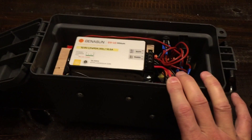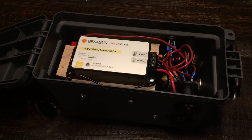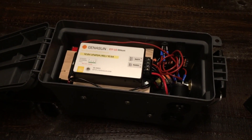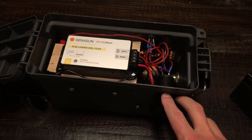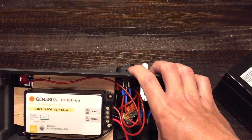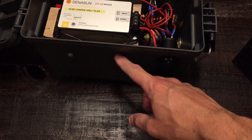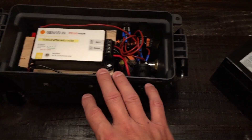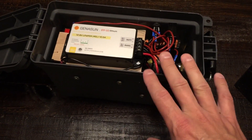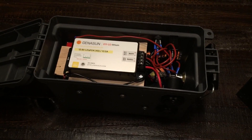I'm going to use a different box on the next build and hopefully get better results. I appreciate everybody's feedback and the comments. There are plenty of options out there. I'm going to take a lot of the feedback I've received and do an update — build out a different box, maybe change some loads, put a meter on here. I have a different smaller push button switch I'd like to try to get a tighter seal. Also got good recommendations on getting rid of these bolts — since this battery is a lot lighter, I don't need to worry about that weight moving around as much. Fewer bolts means less weight and fewer points of entry for moisture. If you liked the video, give me a thumbs up, subscribe, and I appreciate you taking the time to watch. Thanks.